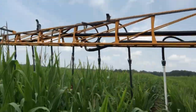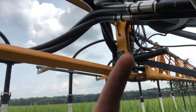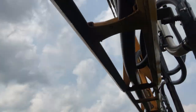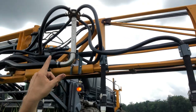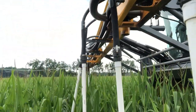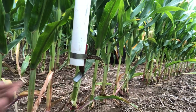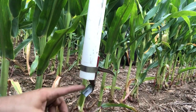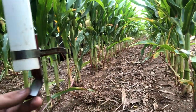The seed gets blown through these big tubes here by air and then goes out through these tubes. Air comes out probably at about 70 to 90 miles an hour, so it's pretty fast. It blows the seed and it hits this little pan — you can see it's shaped on an angle — and then blows the seed out from there.